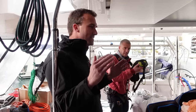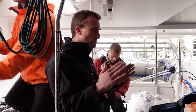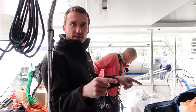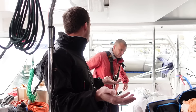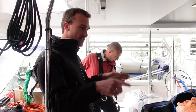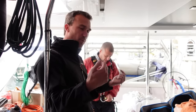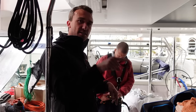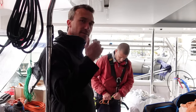So then once the outside caps are on, you put the inside ones on and you can tension them, I guess, to full tension. And then you have to recheck the outside shrouds because the inside shrouds could potentially pull a bit of tension off the outside ones. So you go outside, outside, inside, inside, and just get it right.